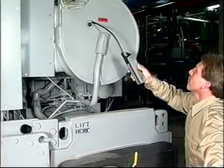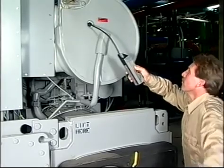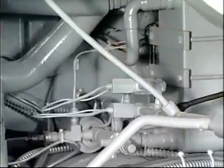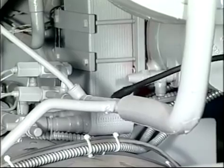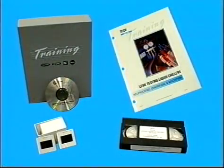If the annual leakage rate for the entire chiller is greater than 10% of the total operating charge, the leak should be repaired immediately. If the total leakage rate is less than this, but greater than 1 pound per year, the leak should be marked and repaired during annual maintenance. A new training program for leak testing liquid chillers is now available. Refer to the workbook appendix for ordering information.